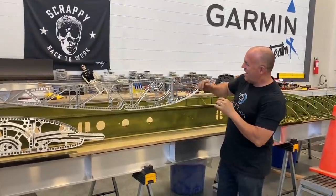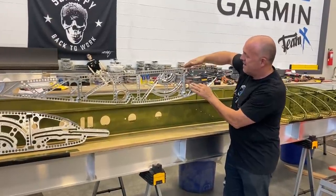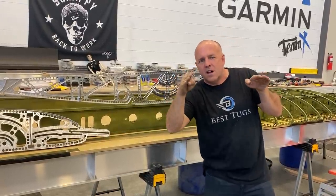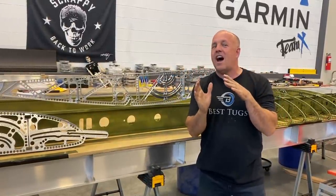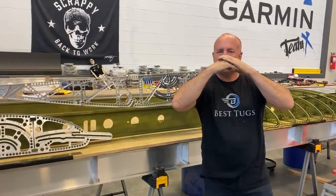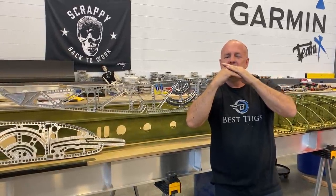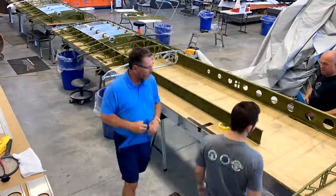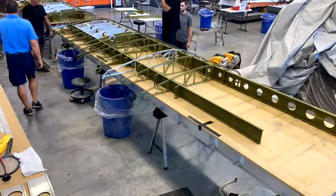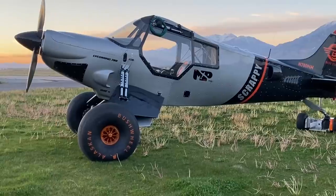All right, so another thing that's really hard to see, but on these ends, there's actually a movement where the arc comes and then makes a little bit steeper dive. That little steeper dive is so that when the slat moves out, it doesn't drag on the paint. It actually has to lift first and then transition its shape and movement. So little details, but I don't want to scuff my paint. So we designed it into the mechanism to prevent it.